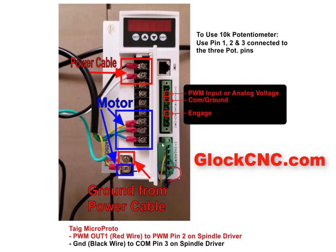The motor power cable, which you see right here, is going to be in the order of these last three hookups: yellow, green, and then blue. And if you see this yellow with a green stripe going through it, that's going to go to the ground section right here. This connector should already be all set up. Now if any of these happen to have come loose, you'll use a screwdriver in the side here — it'll open up like a little clamping mechanism — and you can put that bare wire back in and clamp it back on.